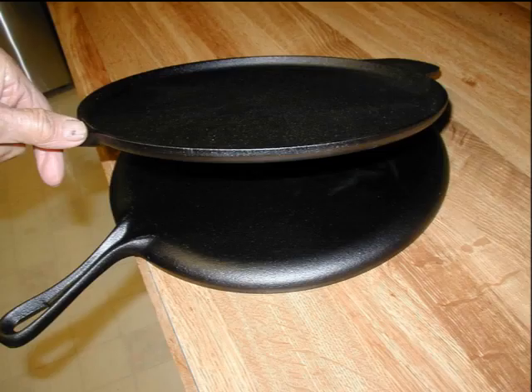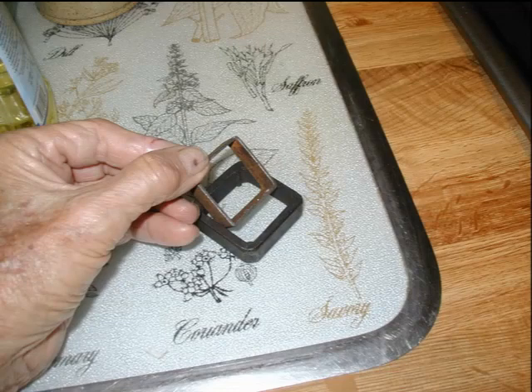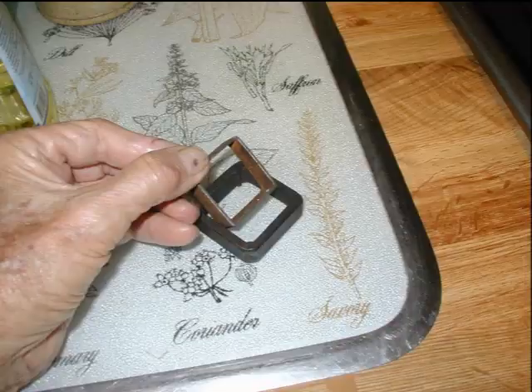Here's how they'd look in use. See how the rear handholds fit on top of each other with just enough room for a hinge. The hinge is made from 1½-inch sections of 2-inch square tubing and a piece of tubing that nests within it, then cut in half to make two U-shapes. I made a hinge to bolt to the handholds at the back of the griddles.